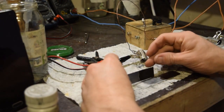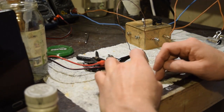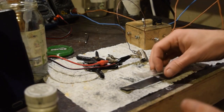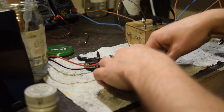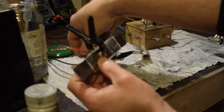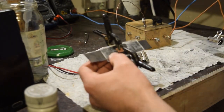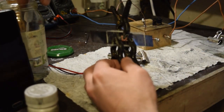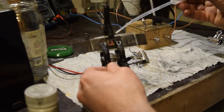The other electrode goes straight over the top of it, then another microscope slide over the top, and put the clips in place. We'll charge it to the same amount of time - probably five or ten minutes. Quite often you find that the majority of the charge happens in the first few seconds.